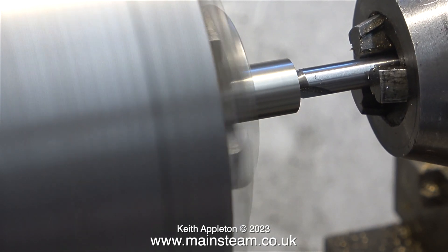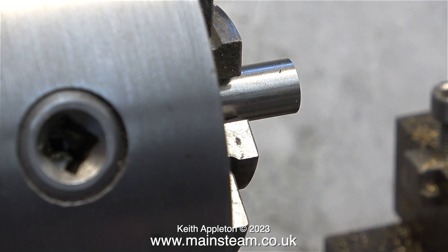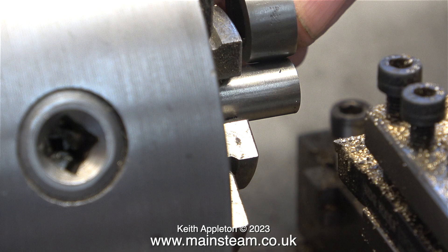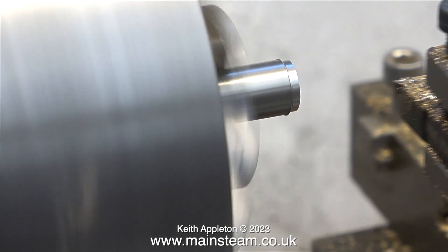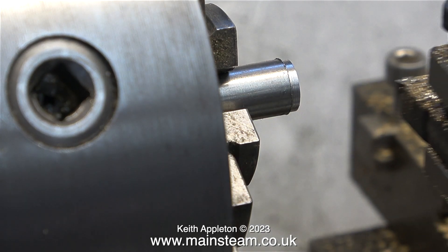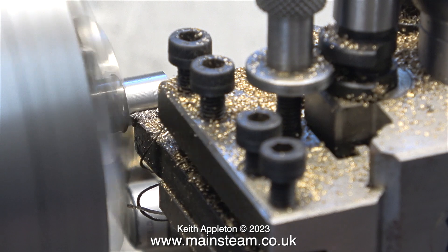Luckily, this recently adjusted Myford and its chuck seems to be quite accurate. It's a Myford ML7R, with the same type of headstock as the Super 7, with quite a substantial taper cone bearing at the front. I need to turn down the piece of bar so that the crank web fits on the end of it with a tiny little bit protruding — this is optional, it just seems to be the way it's done on full-size steam engines and locomotives. I've just noticed that for this operation I seem to have picked the bluntest of my carbide-tipped tools. The finish is not too bad, and I'm not bothered about the finish for the part going inside the crank web. You can tell by the sound of the tool against the metal that it's not very sharp, and this has really shown up by the silver steel, which is quite a hard material.